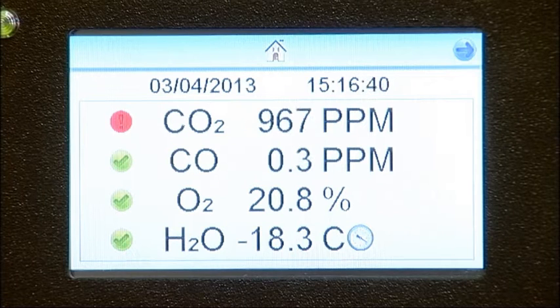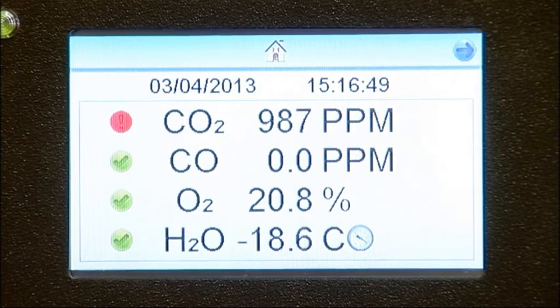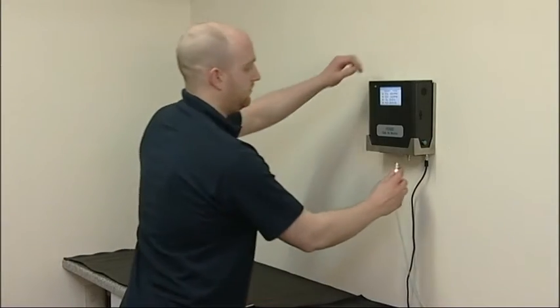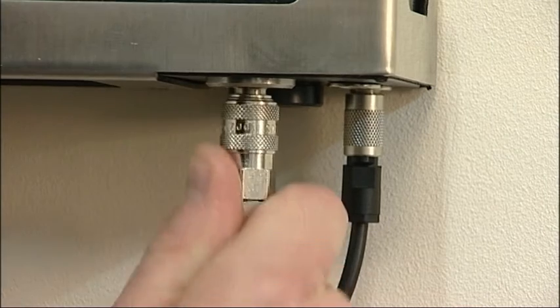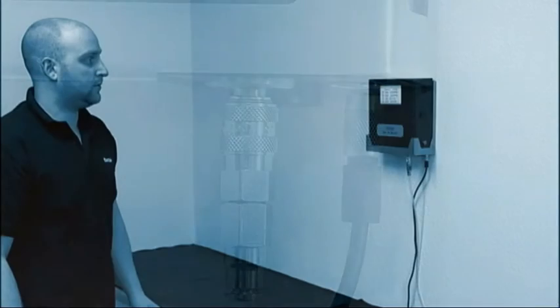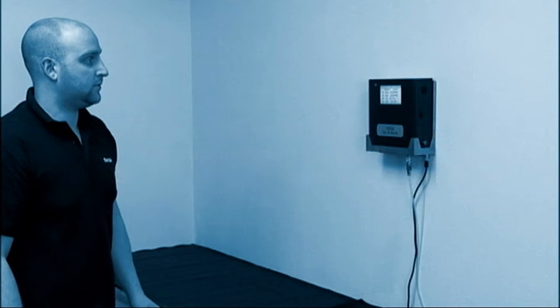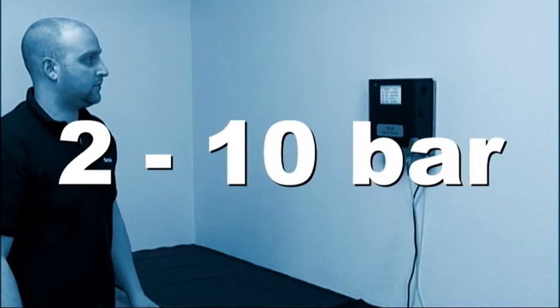At this point, you can then connect the breathing air supply to the air inlet. This training video is for the F6100 connected to an airline system. When checking an airline system, connect it to the air supply to be tested. Fit the appropriate adapter to the tester first and then connect the supply hose to the adapter. Alternative adapters for the most popular BA connections are available from Factair. Please note that the tester can be piped to any pressure between 2 and 10 bar.